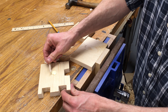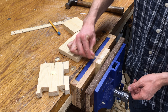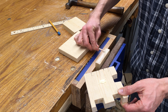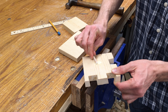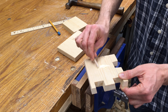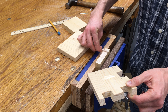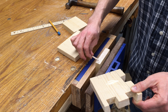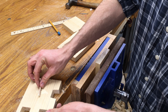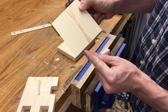First things first, let's go ahead and apply the glue. I've got a little scrap piece of wood and a dowel rod — I'm going to put the glue on the end grain. End grain tends to soak up glue like crazy, so I'm going to apply it pretty liberally across the end grain and spread it out. You can let it sit for a minute; because the end grain is so porous it soaks up the glue, and then you put just a little bit more on to give it a coating so it doesn't soak in as much and can attach to your other piece better.